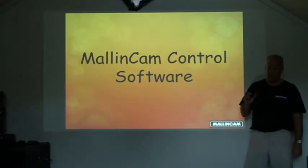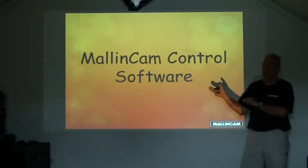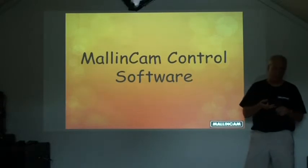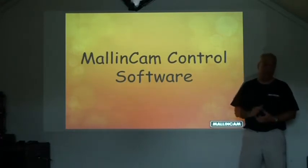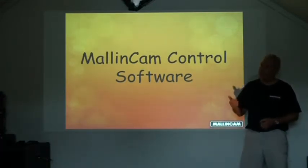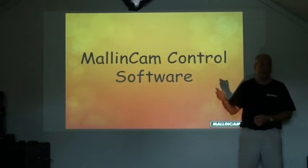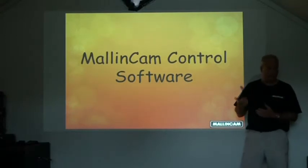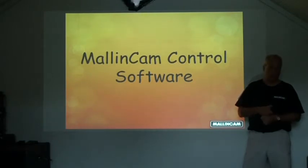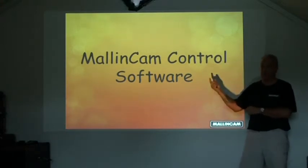Now, the nice thing about it is that all of the MallinCam cameras, and I'm not talking about the imagers, I'm talking about the videos, right? So the Junior Pro, the Extreme, the X2, and the now announced Exterminator, the back end stuff is all the same. So what I teach you about one interface applies to all the cameras, as long as the camera has the feature enabled. One of them is going to be the thermoelectric cooler circuit and how that handles the cooling of the chip. You'll understand that the Junior doesn't have that, right? The Extreme has the cooling circuitry in it. So it'll come up, and you'll see when I talk about a certain feature that's not available in a certain camera.